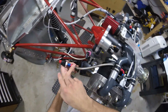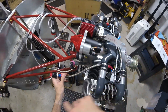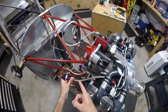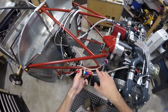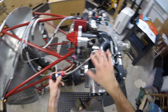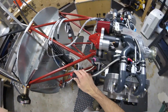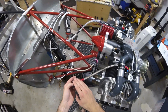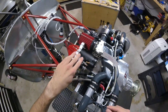After that braided line you've got a check valve, and so this is your return line. I'm not exactly 100% sure how we're going to run all the fuel lines yet, but the idea is it's a continuous flow system. When you have the fuel pumps going — we're going to have two for redundancy — it just flows through here. Any excess fuel, and there's quite a bit, comes back through here and has to return to the tank. Blocking this would be bad — don't do that.